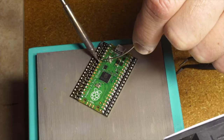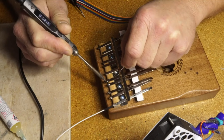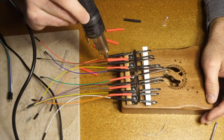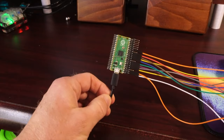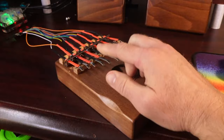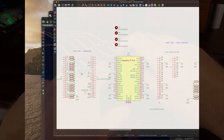This was implemented in my larger cat kalimba using a board with 16 one mega ohm SMD resistors for capacitive sensing. It had a cutaway slash rat bite design that meant it could be separated as needed and was made on a 0.8 millimeter PCB. This worked as a design, but I found that I really didn't like soldering on all those resistors and that the rat bite setup wasn't really necessary. Still, it was an interesting PCB that deserved another revision.